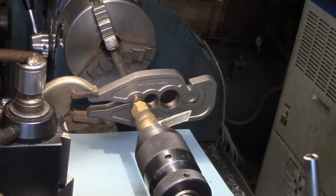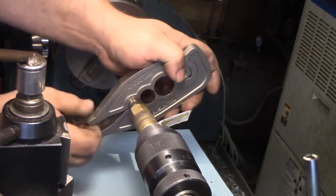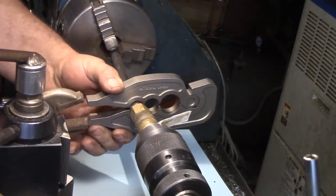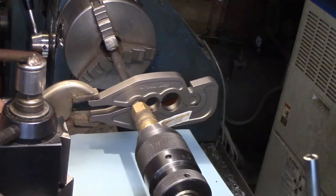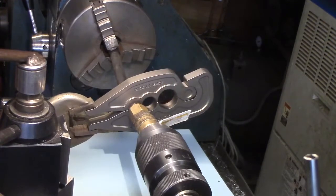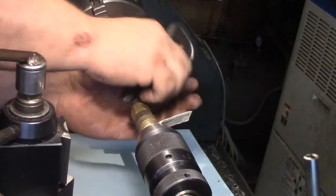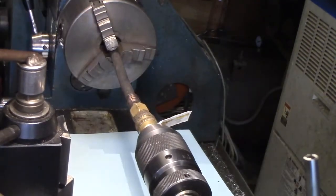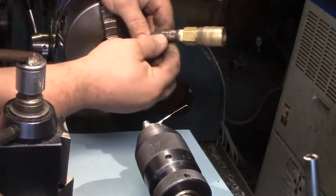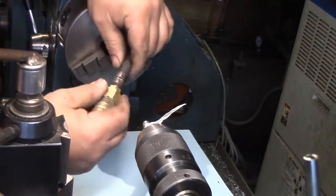But I'm going to double crimp it anyway, because it's an air hose. I'm the inspector, and I can do any damn thing I want in my shop. I just want an air fitting that's not going to give me cuts, blisters, and catch up and hang on things. Okay, that is PEX tool, PEX ends. No modifications other than our chamfer to make it go on easier. And there you have it.